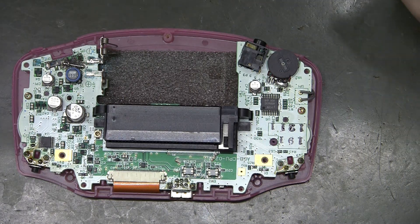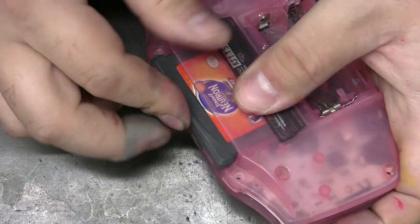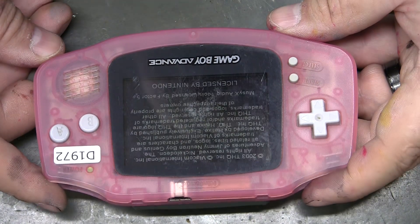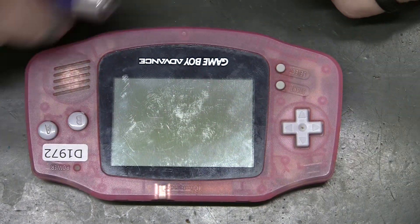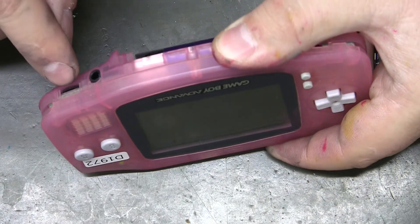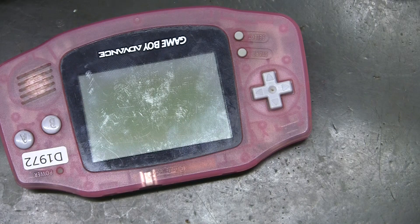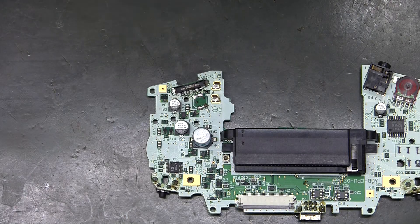Use whatever volume control on your TV. I'll put this back together to prove it — since I've done the power bypass, it will automatically start coming on. You can tell that was full volume right away. The volume knob turned all the way down, all the way right, all the way back left — makes no difference. That proves it works and goes to full volume after bridging those three pads.